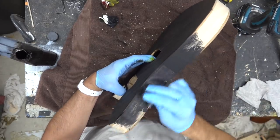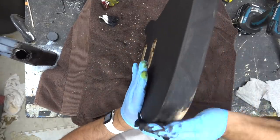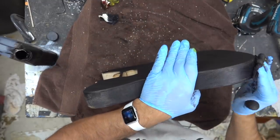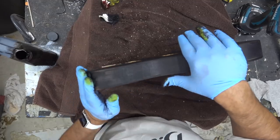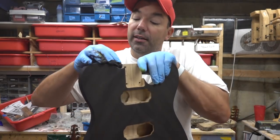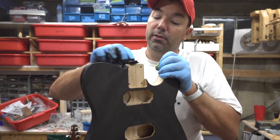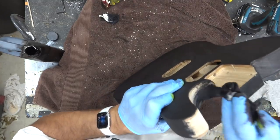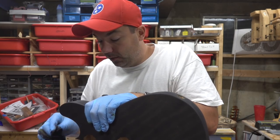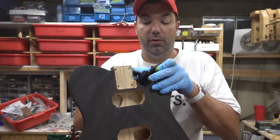I'm curious how many of you are yelling at me right now for putting stain on this, but I've been doing stains for 14-15 years - almost as long as I've been on YouTube. The blue burst double cut I did was sort of my big video, and that's what got me to say I should do more YouTube videos because everyone liked it. You can see a little bit of hide glue here and there. I'm not using grain filler - you don't need that mirror look. I'm leaning towards an oil-based finish to get that nice well-worn look.